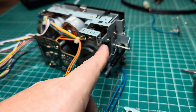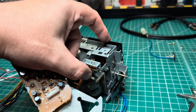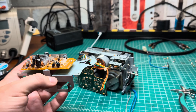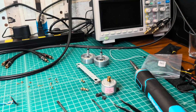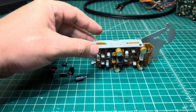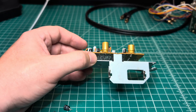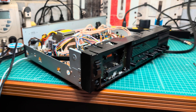I had to break off this connecting piece because I need it to connect and hold the part with the sensor. I'll still use this piece for shielding the playback amplifier, and I'll install it all together in the deck so no parts are left out. I've now completed recapping the playback amplifier and power supply — I installed FG Gold capacitors on the power supply and solid polymer 10 microfarad Nichicon capacitors on the sound path. Now it's time to assemble.